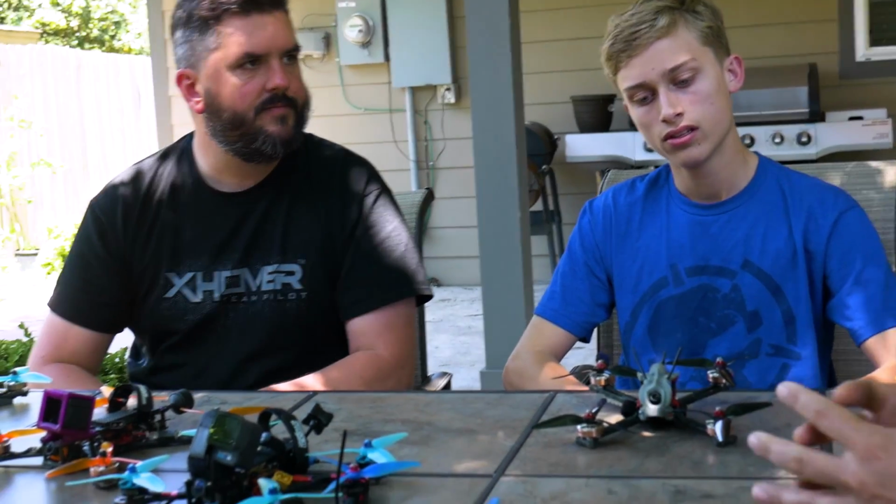Well, now, in theory, but if you are hovering, then yes, you'll get the longer flight times. But when you're in fast forward flight, such as racing, the bigger use of that battery is going to be overcoming drag more so than holding it in the air. At that point, holding it in the air is like a small sliver of where that thrust is going to. Most of it's going to making turns and maintaining speed and overcoming air resistance. Exactly. Overcoming air resistance. Yeah.